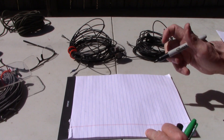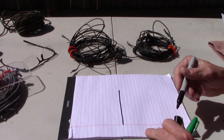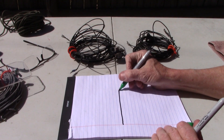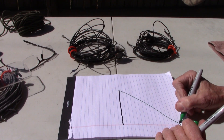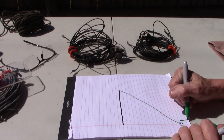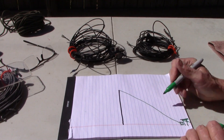If you're going to use an end-fed half wave, then you would run your pole up to its length, tie off your wire first to the top of the pole, and just pull it up. You're going to put your box down over here, and if you plan it just right, you can put that right near your picnic bench, wherever you're going to set up.